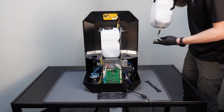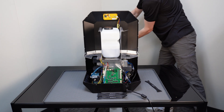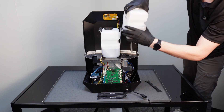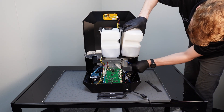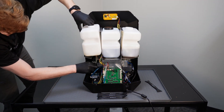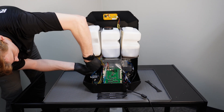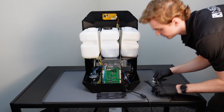Due to our onboard cleaning system there's no risk of cross-contamination. I clamp the tubing to ensure no leaks and use one of our demolding tools to remove the tubing from the pump body — it's that easy. These demolding tools and clamps are available on our website. We also have spare tanks and a variety of materials you can use with the machine. After I swap the tanks I can remove the clamps from the tubing, and just like that we can inject a different kind of material with the same machine. It's that quick.